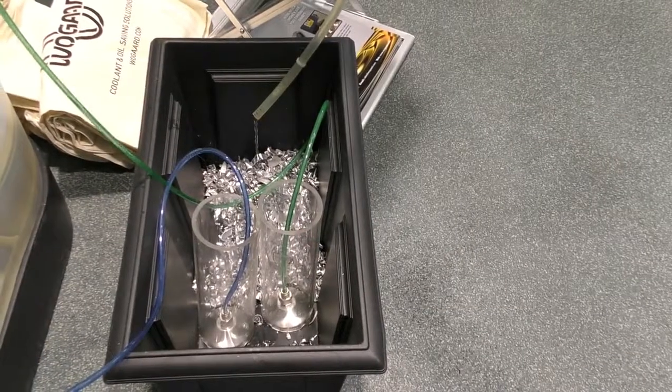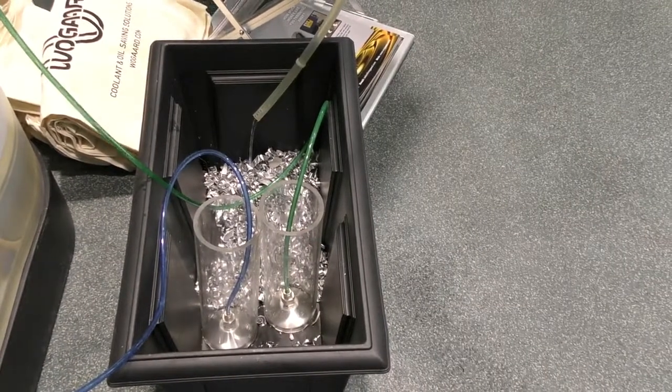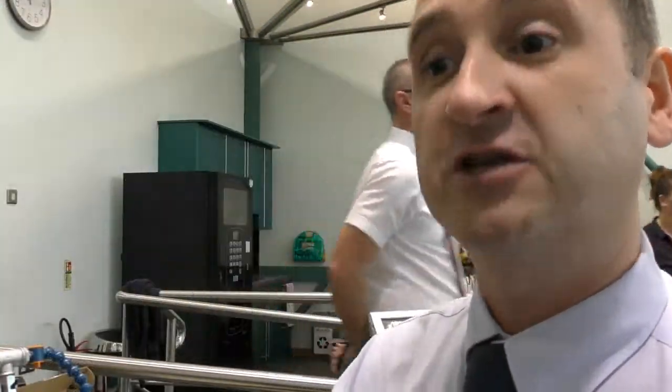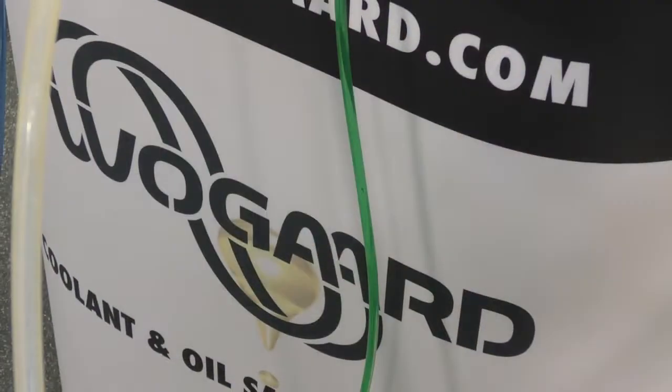Creating a sideways suction, we have a filtered cup, a vacuum, that sits in the swarf bin. We usually put a surround in it so you can easily take it in and out when the bin's full. As soon as the machine's up and running, we have suction. So the fresh coolant that goes straight into the swarf bin is automatically sucked up, returned and pulled back into the sump, resulting in a massive saving in coolant.